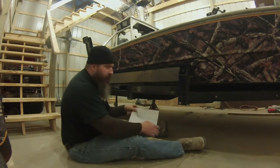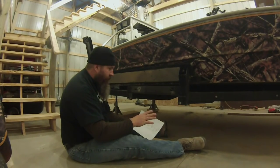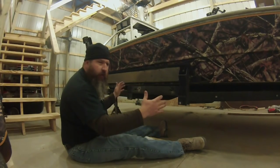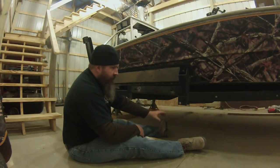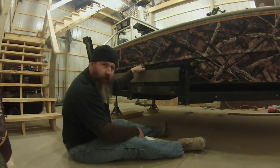Once you guys are on eTrailer.com and you scroll down, once you're looking at the parts list, I'm pretty sure it's on the springs. Once you look at the springs PR722 or the Easy Hanger Kit AP233-H248, you can just search that at the top and it'll take you right to it. But as you scroll down, it'll tell you the parameters in which these setups hang. So I already know that my axles are going to be 34 inches apart on center. The top, or the center of the axle to the bottom of the frame, is only going to be 4 inches, and that's what we want. We want it to ride low because it's a boat trailer. That way we don't have to back halfway out in the water to get our boat off.